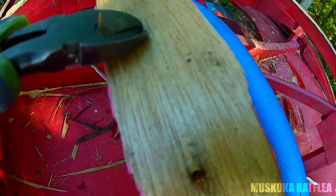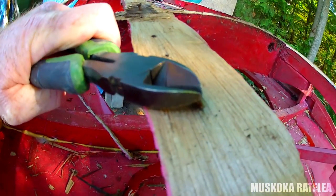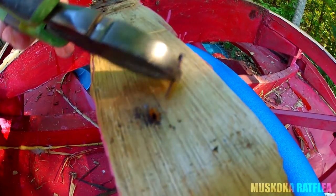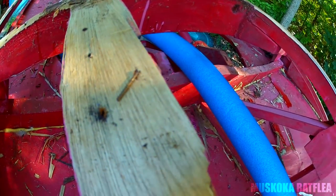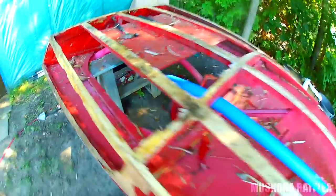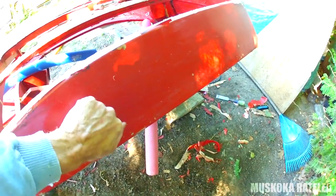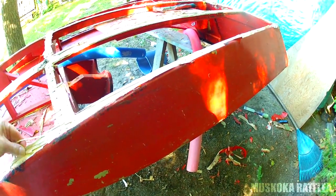Let me pull one out for you - there it is, right there. They're about three quarters of an inch or an inch long, just very tiny finishing nails - and those are the nails the whole plywood hull was put on with. The good news is these side bits right here are fairly intact, so I'm not going to replace those - I'm just going to sand them down. I do have to replace this entire side here, but I've decided to keep this side. It's probably the only part of the hull not dry rotted out, and it's just going to make my rat rod renovation look kind of cool.